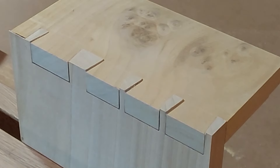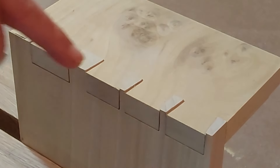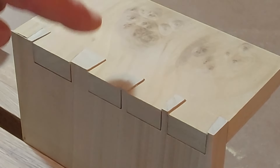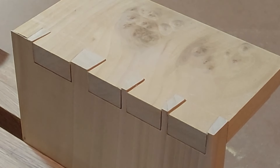That's it for hand-cut dovetails. The next step will be during the glue-up — how I deal with all these little gaps. The important thing is that there are no cracks, nothing glaring; all this can be dealt with during the glue-up. After the glue-up, sanding the pins — they protrude just a tiny bit — and when you sand those into the gaps it looks like a completed corner joint. The next video will be cutting the rabbets and getting the four sides and the bottom of the box ready to glue up. Thank you for watching.